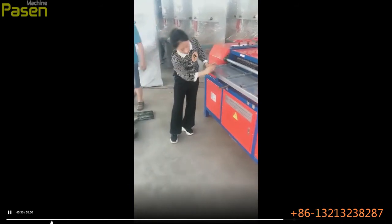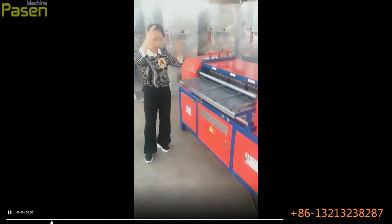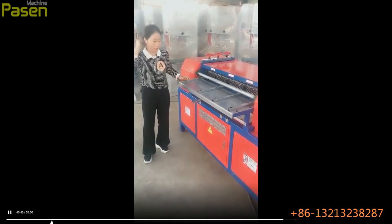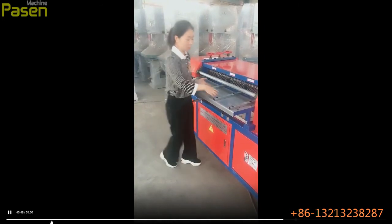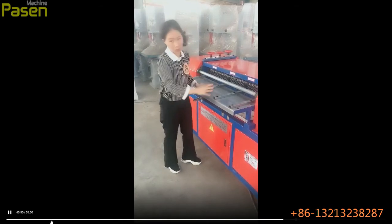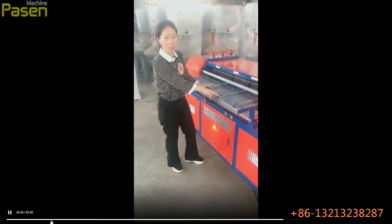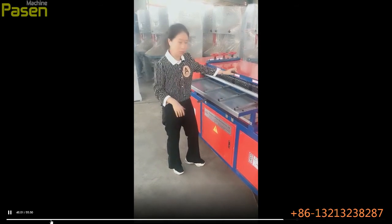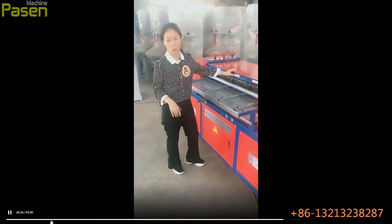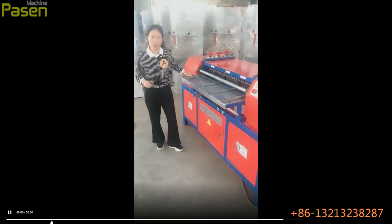this one is under its position, to make sure the lower blade is covered, and it could process the single layer. And you could notice that when Mr. John feeds the material inside, it is a different size, so it cannot process. So when you want to process the radiator, you must make sure that the size of the raw material and this one is right. Otherwise, it cannot process. And now let us show you the double layer.